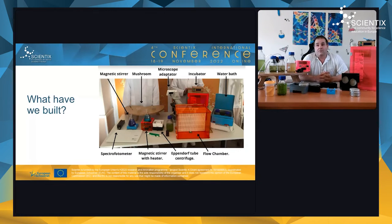You might notice what looks like a fryer — that is exactly what it is. We transformed an old fryer into a water bath, which is very useful in a lab for controlling the temperature of reactions and cultures. We also built a bacterial incubator that controls temperature between 25 and 35 degrees for culturing bacteria and microalgae, regulated by a sensor, a fan, and a heater.